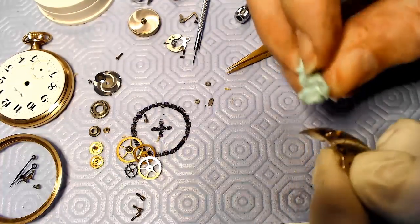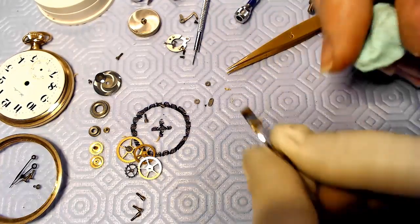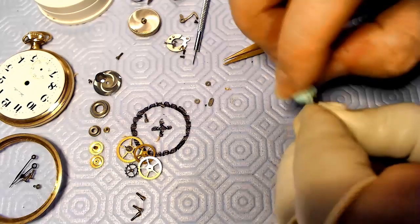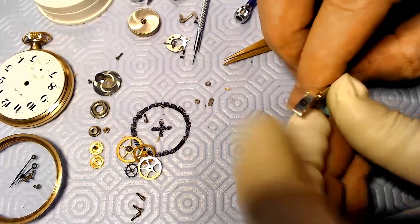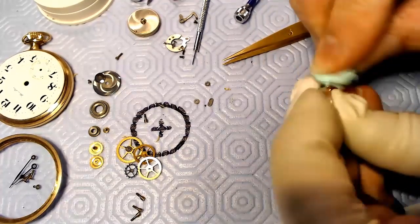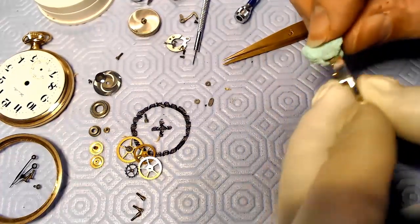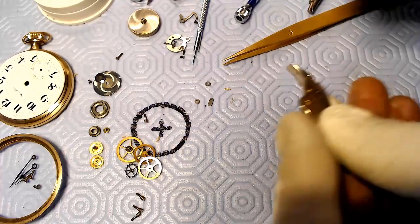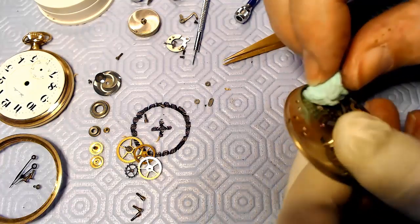And if you see there's a little tiny bit of corrosion there. See that? Right there. And if I get in there nice and close and I rub that with the Rodico, you will see that the corrosion is gone. Little spot right there, and this is a magic mud there, completely gone and shined up nicely. So this is a Rodico, which is phenomenal, and it also puts a nice shine on the top of the movement. So Rodico it's the new duct tape. It's man's best friend.